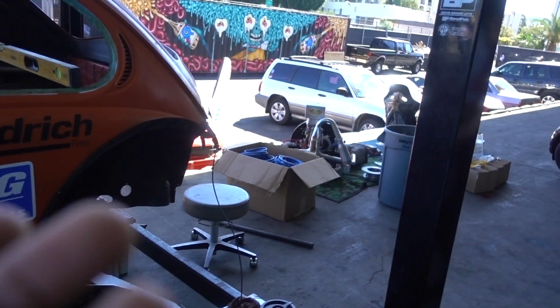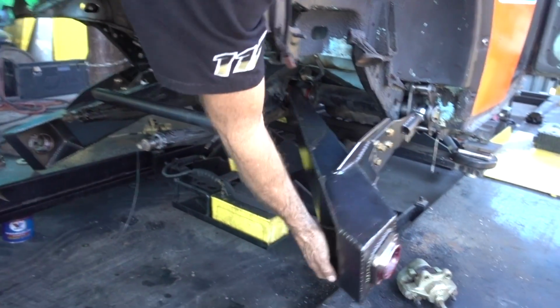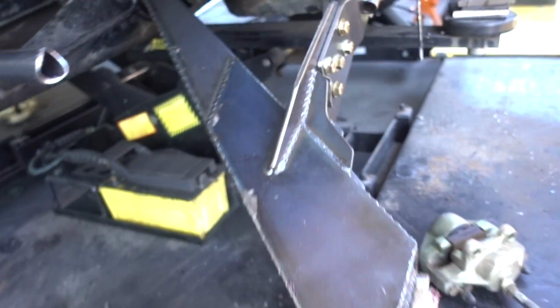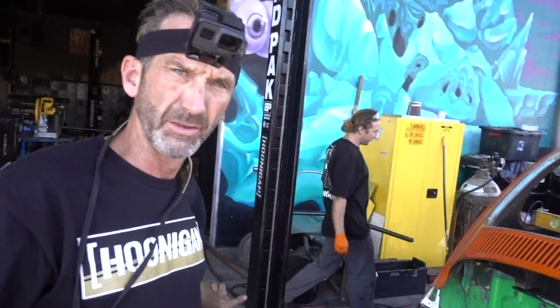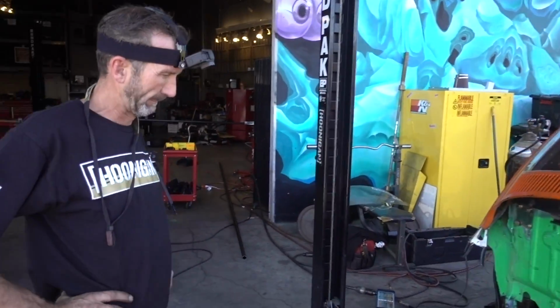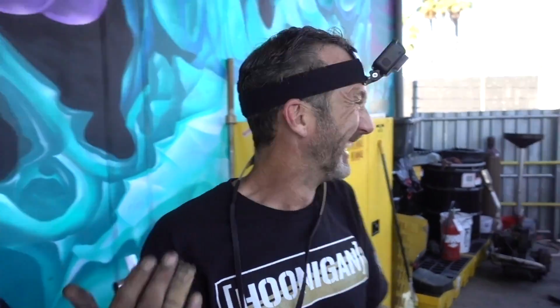Can you show me this thing over here though? Yes, these are 3x3 chromoly plated trailing arms. They actually are 3 inches longer and 3 inches further back, so it gives it a more stable ride for the Volkswagen. Right, and longer travel. You guys are making moves. This thing's gonna be tough, huh? It's gonna be one of the baddest Bajas I've built. I had more motor than this, but this has way more suspension than my last one. I'm not surprised you had more motor and less.